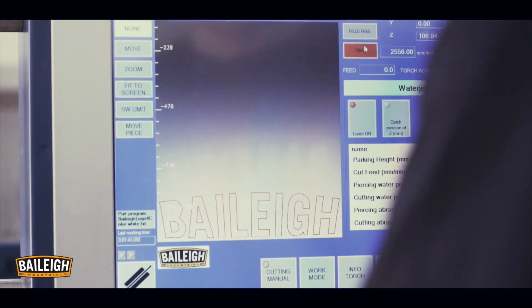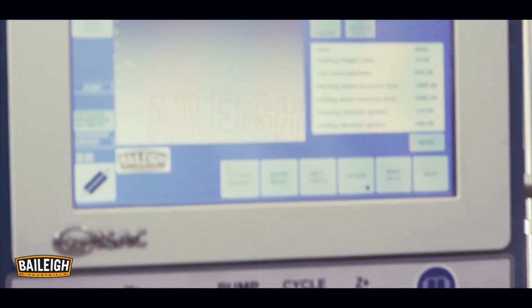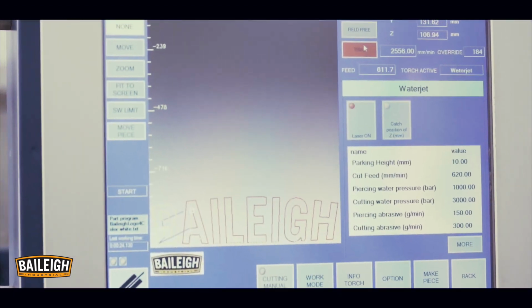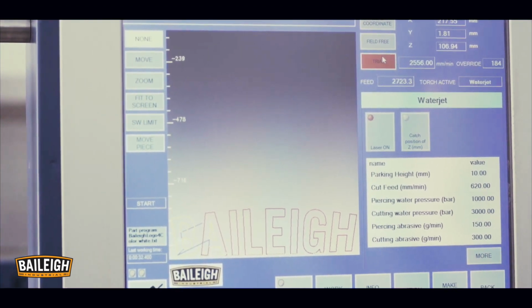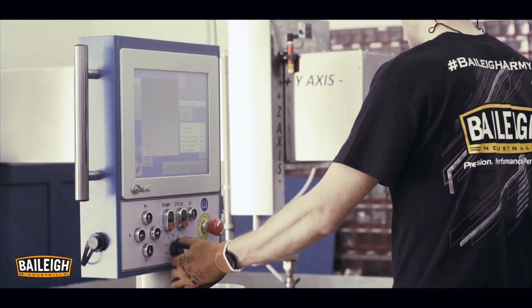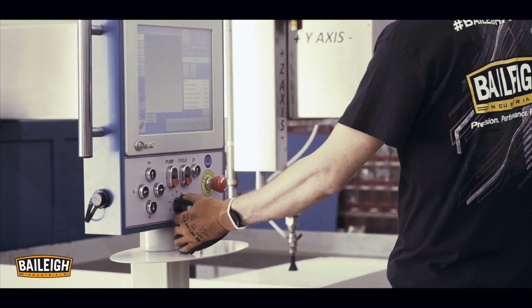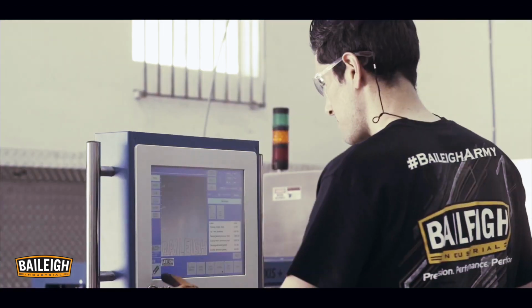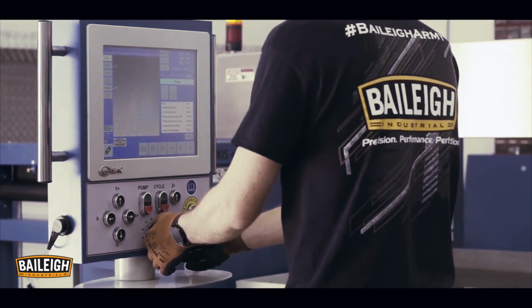Cutting material. Having converted a drawing using CAD software, copy the G-code to the PC from the work file screen. Locate the corresponding desired 0 coordinates of the actual material being cut. When the nozzle has been moved to this position, press 0 coordinate. Approach the nozzle via the Z-axis to a height of around 5 millimeters above the workface. Press reset and catch Z position to perform a trial cut.